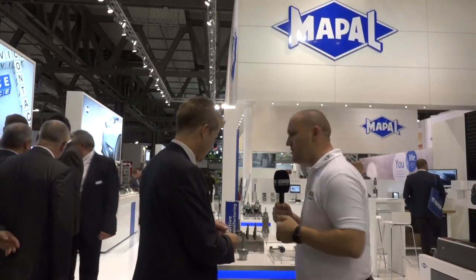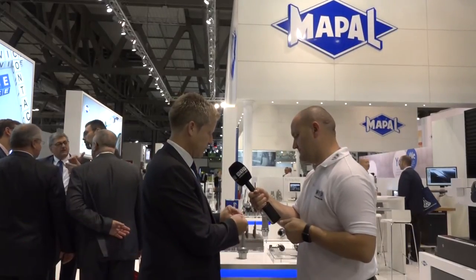What are the features and benefits? Why would you do that? Obviously with the additive machining process, it allows us to take a steel shank, build up the layers of the material, and also allows us to have a unique triangular coolant outlet, which allows a greater flow and improved tool life for the customer.